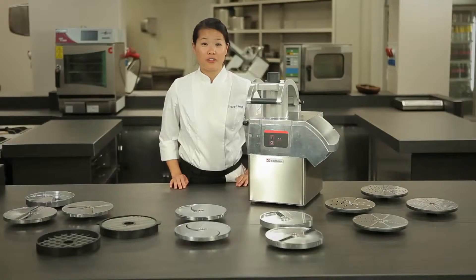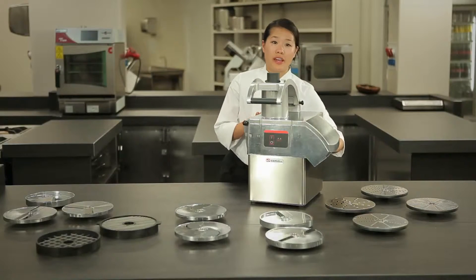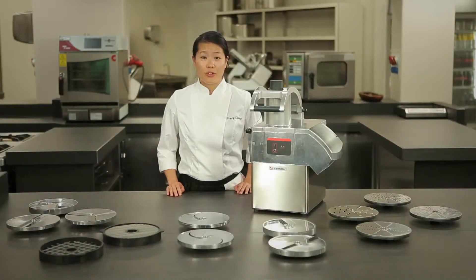Its design is space efficient. Here we enter the products from the top and they exit from the side. The machine uses a variety of disks and grids. Grids are always accompanied by disks, otherwise the machine does not run. With the different combinations of disks and grids, we can produce over 70 different cuts of vegetables — from sliced tomatoes at 2 millimeters thin to large diced potatoes at 25 millimeters.